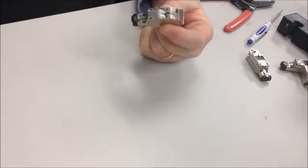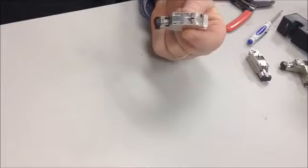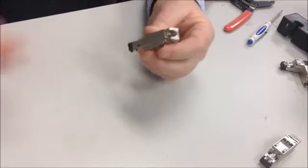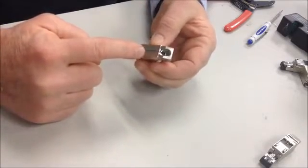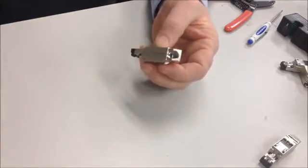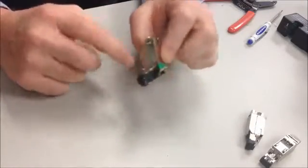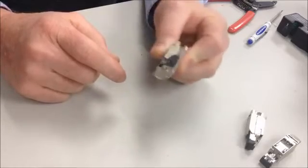The connectors come in three different designs. One being the 180 degree straight through connector, which I'm holding in my hand here. Another option you have is the 145 degree angled outlet — you can see how it's angled here. This would be something you may use on the Simotion products or Sinamics Drive products. The third connector we have here is a 90 degree, and you can see it definitely comes out as a 90, and we would probably use this on one of our ET200S products.